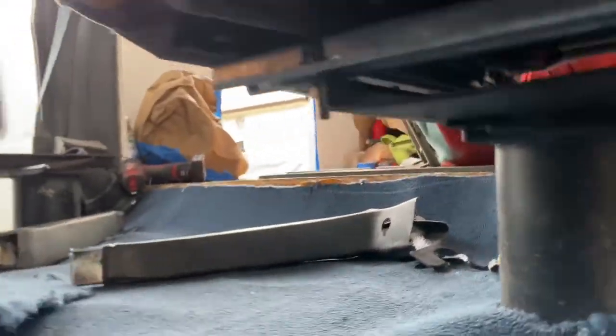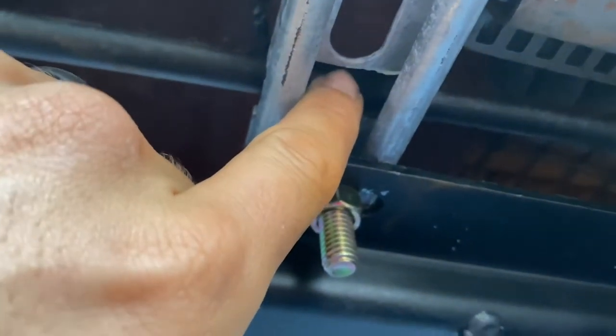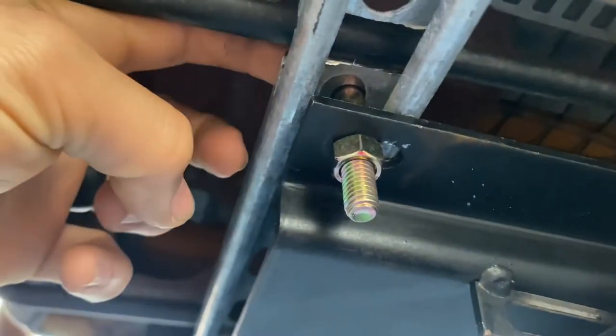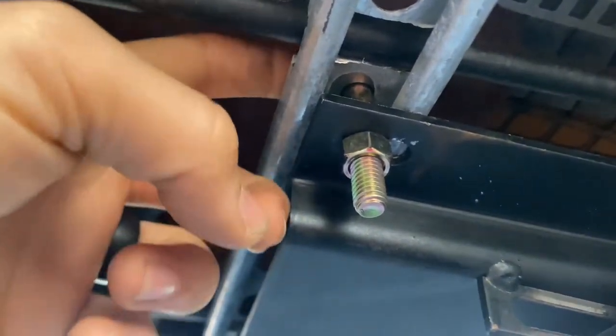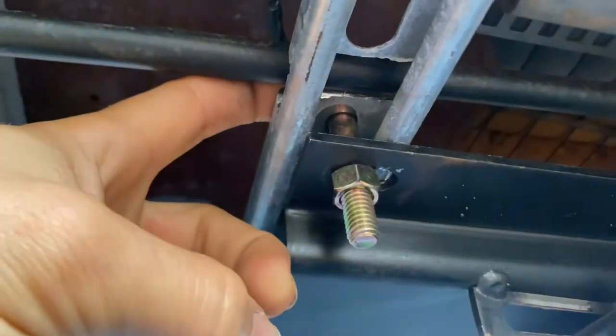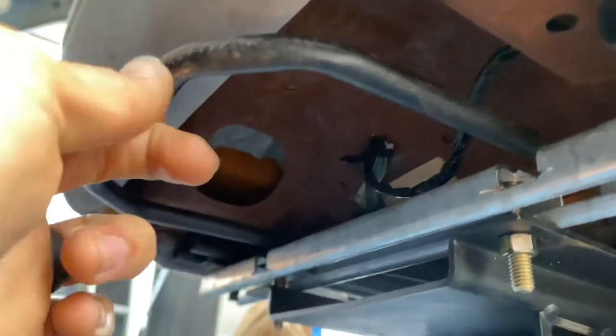What I was saying about the holes — try to cut in between the holes so that when you put your bolt and washer, you're not risking it slipping through. Even with a decent-sized washer it probably won't slip, but better safe than sorry. It's working pretty great and I'm pretty satisfied with it.